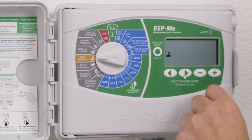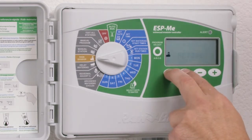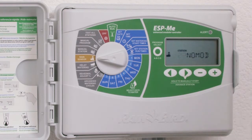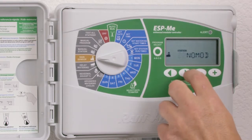Once the status has been set to active and you've determined that you have specific stations that you want to bypass the rain sensor, press and hold the two arrow key and it brings up the menu for the stations. In this case, station 22 is showing no mod, which means that there is no station 22 installed.